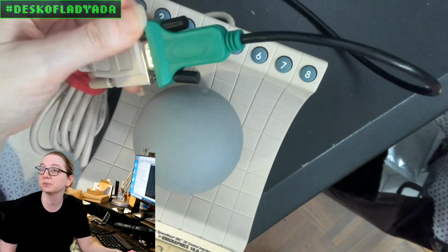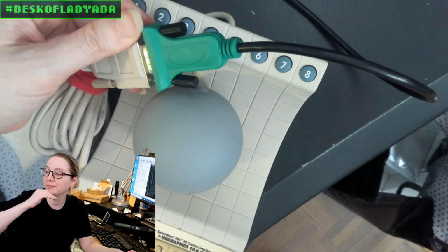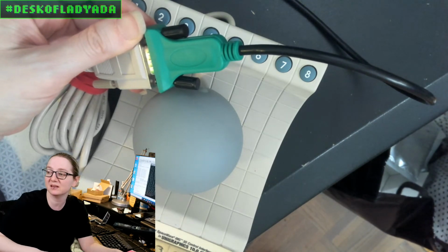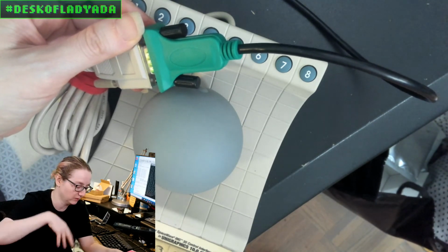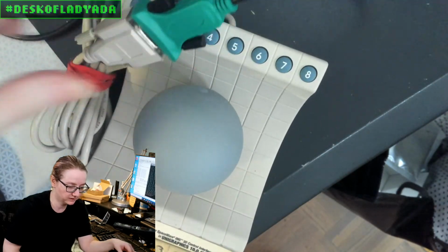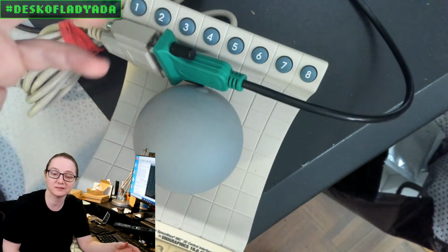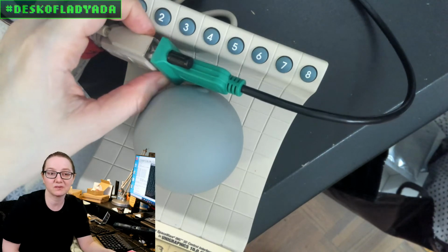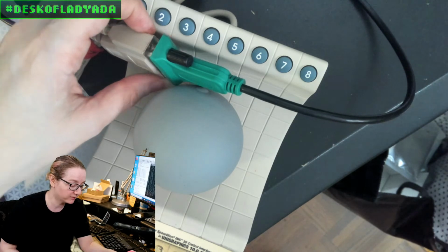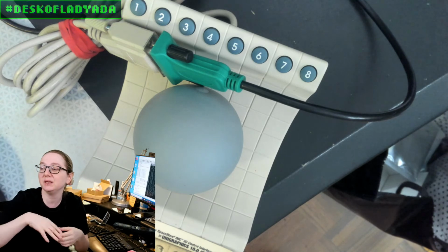Whereas on RS-232 serial, it's plus or minus, and it's inverted. What would normally be a high level, like 3.3 volts, is actually -6. So it's inverted, and it's also this wide voltage swing. That's because this is a non-differential signal, and this was meant to go long distances. To deal with the resistance of the cables, they would just have a really wide voltage range. As the cable got farther and farther, the signal would shrink down, but it would still be plus or minus some voltage.